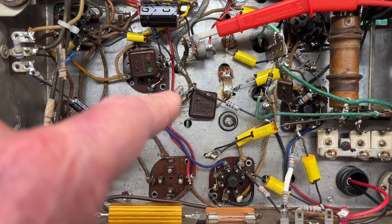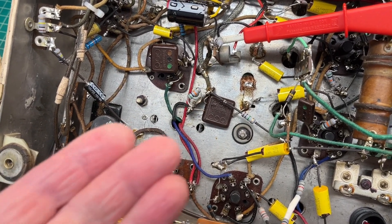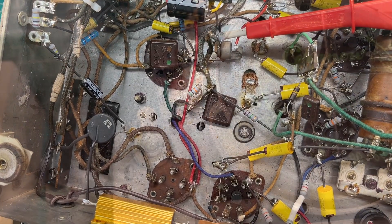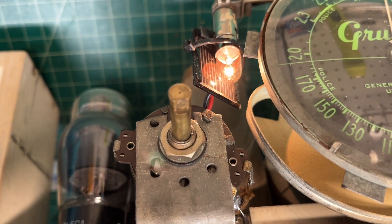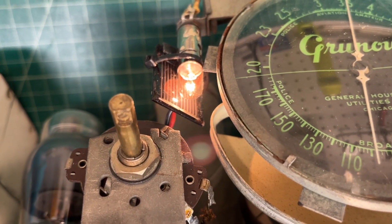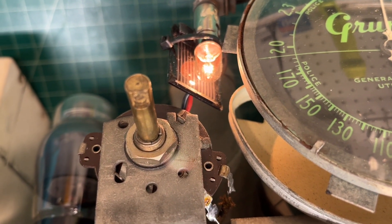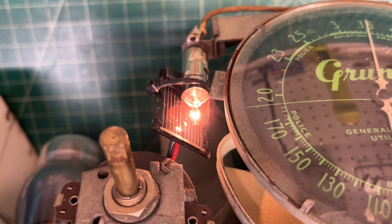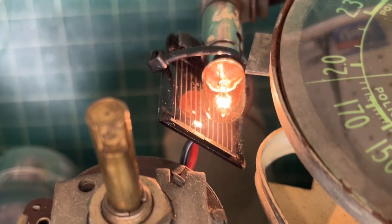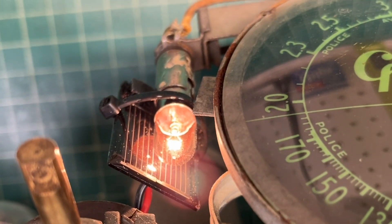Let me show you what I did on top. I don't have a battery in here — this is where old technology meets new technology. There's a look at my solution: I've got a little small miniature solar cell, and it's attached there in close proximity to the dial lamp itself. Should the dial lamp go out, of course we'll lose the bias voltage. No battery to worry about. I had some of these left over from an Arduino project, so I thought I would just give it a try and see.